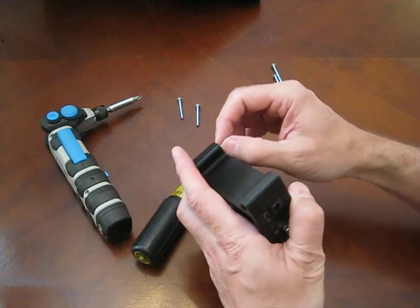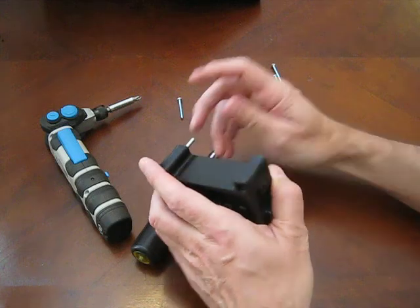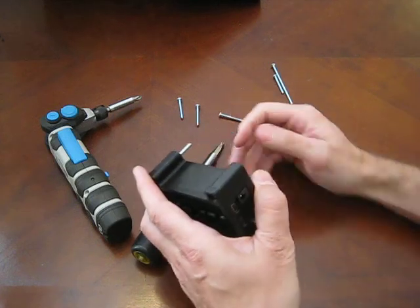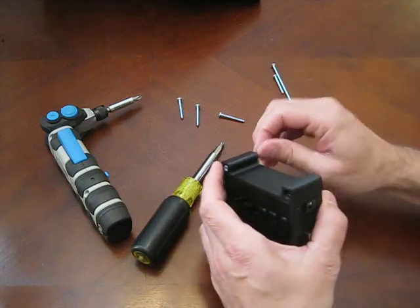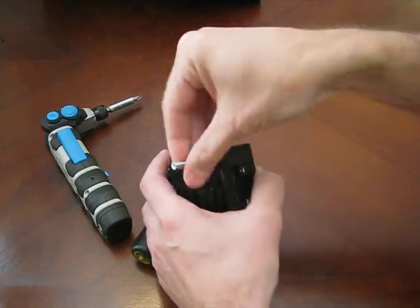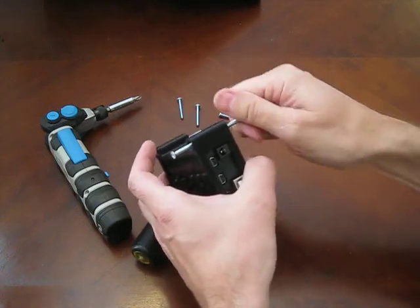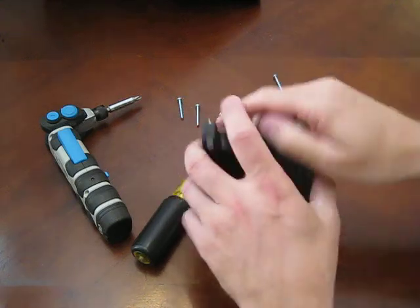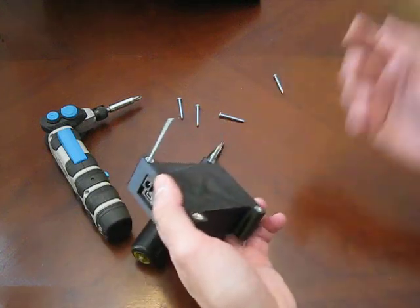What you can do is drill these common size hole distances, slide it into a plate, and then take another nut — or a lock nut or whatever — and tighten it. Now, if I have a little short quarter inch plate I could use this, or three eighths inch, I could use this. But even if I had something super long I had to go through, you can use any common size you wish for these number six screws. They tighten against themselves — tightening against this nut in here — and it holds the lid on. So if you're moving it, the guts don't fall out.